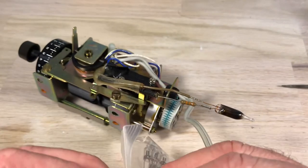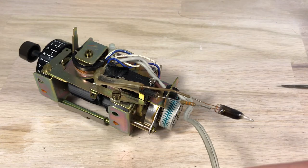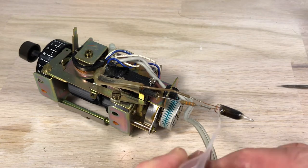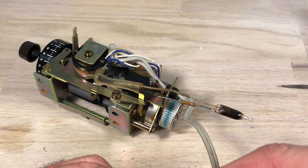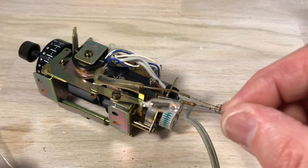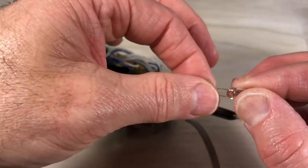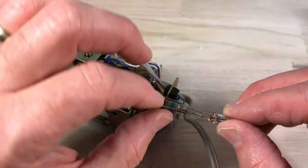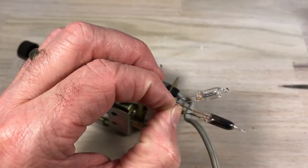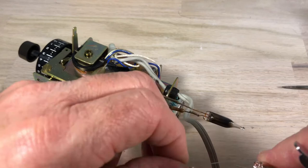What I'm going to use is some bulbs from this company — C2A. They're not exact replacements; you're going to find it's real hard to find an exact bulb unless you get a vintage bulb. These tend to be a little smaller, but the light output is very fine and I think it's going to work just fine — it gives the same lighting. You can see the bulb compared there; it's a little smaller but it's going to fit fine. You could use the same resistor, but the company I bought from includes resistors. Every bulb is going to have a certain resistor rating — let's look at your specifications. These came with resistors, so I like that.